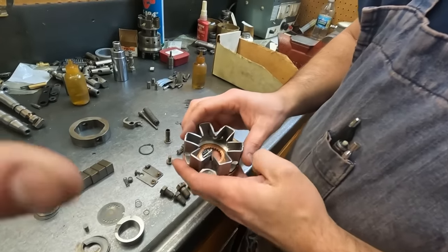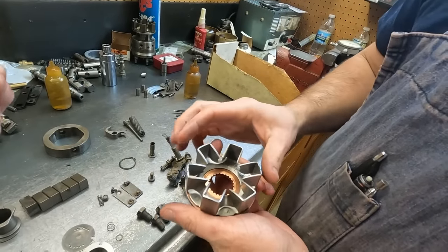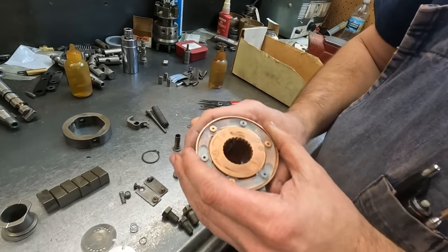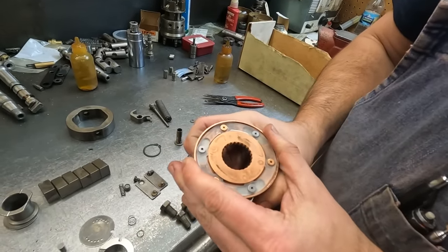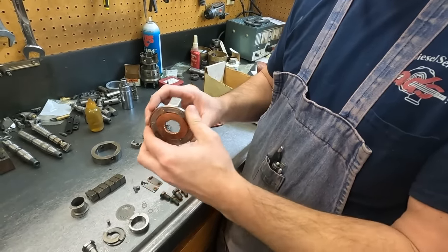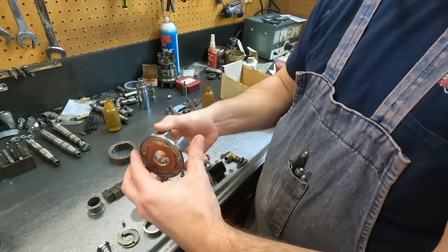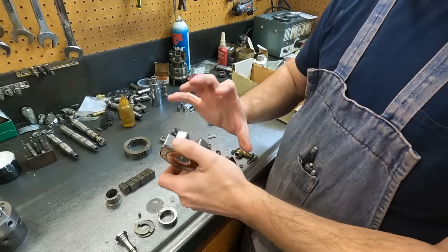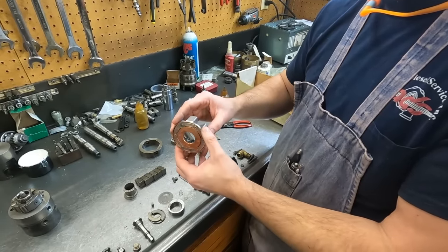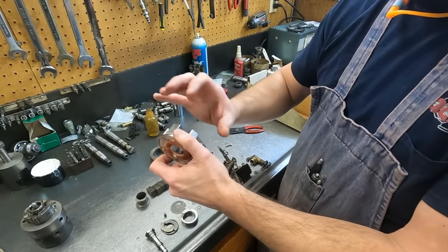That makes sense. And so explain to me why is that there, and what is the thought behind it, rather than it being solid like they kind of changed to eventually? So basically, this one having the flex ring is just to give it enough of a cushion, enough flex. So that way, as the pump is running, it helps cushion the action of it going against the cam lobe, because it's hitting every single time. So it helps give it some cushion there, so it doesn't just jar, and also it helps smooth out your governor a little bit. Makes sense. That's why whenever that's broke, a lot of times guys will have their tractor RPMs just not be steady, and it'll jump around because it's clacking inside.